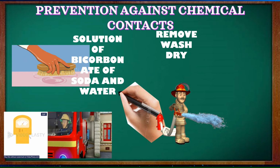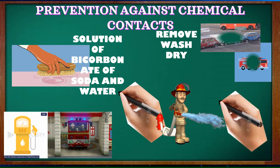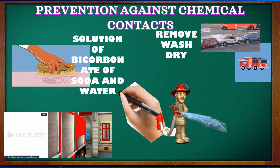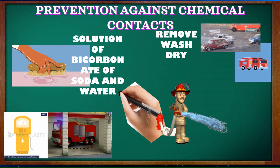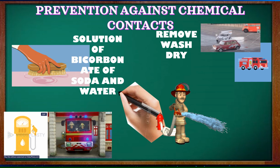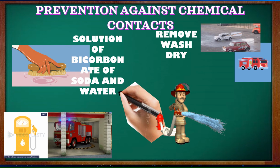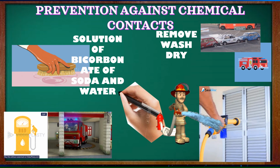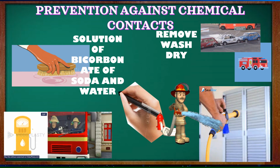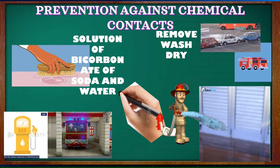Avoid laying hose in the gutter or where automobiles have parked next to the curb, because parked cars drip oil from the mechanical components and acid from the battery. Then run-off water from the fire may also carry various foreign materials that can damage fire hose.